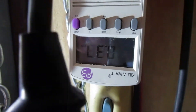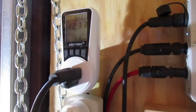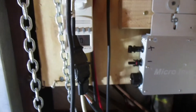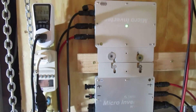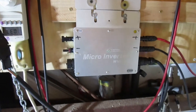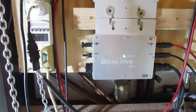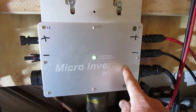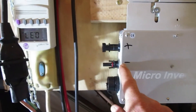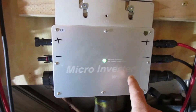So they'll start producing now because we've got them in direct sunlight — two panels on the roof, like I showed you in the other part of the video. Like I said, this is not a professional hookup, this is just a testing setup. We just wanted to see if you could run those two panels on that one inverter. 305 watts is too much. So probably what I'm going to have to do is take this one here that I have one 305-watt panel hooked up to and tie in another 100-watt panel on the other side, and it should be enough for this thing to handle.